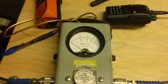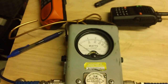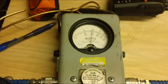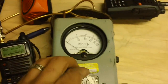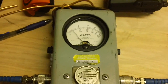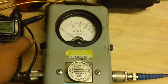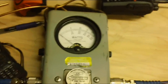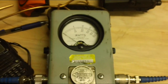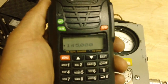Transmitter test from the low end of the spectrum - the lowest I could go is 51 megahertz, six meter band. Forward power is almost four watts. Now reflected power - that looks like almost one watt, about 800 milliwatts. That's definitely past ten percent, so six meters on this antenna is not a good idea to transmit on.